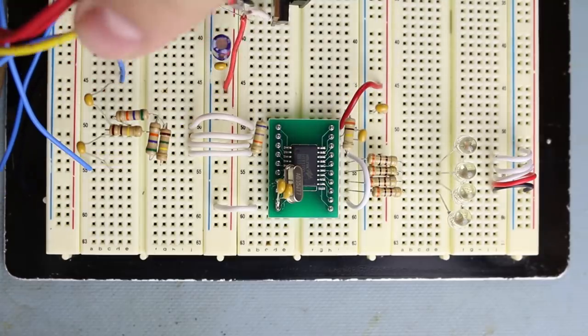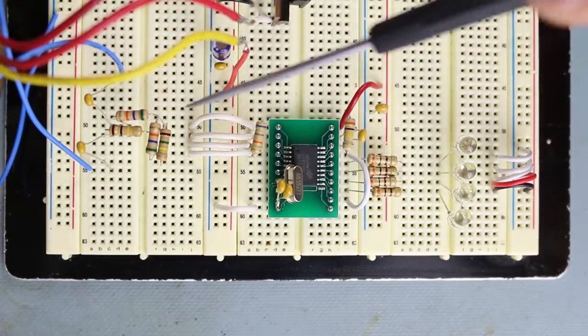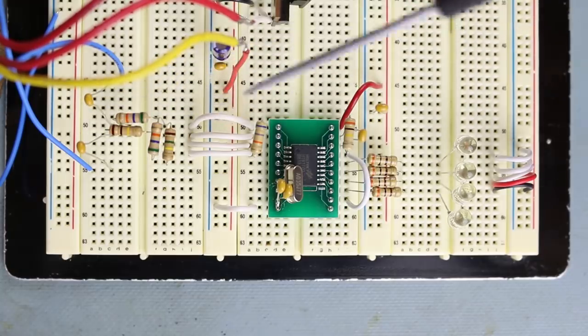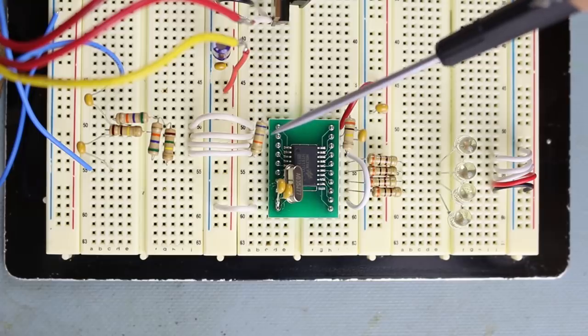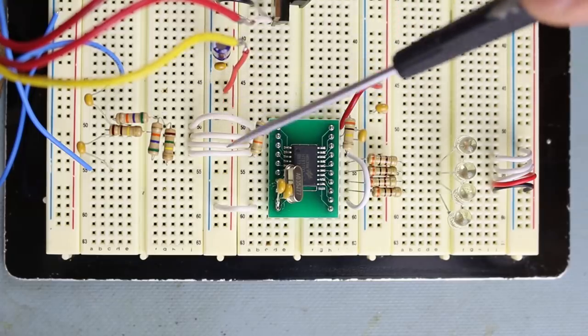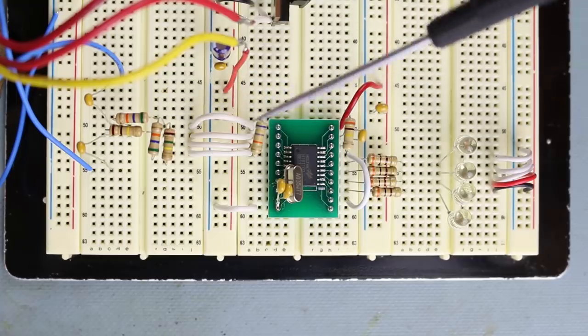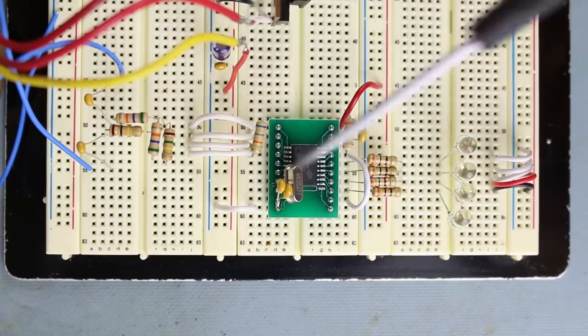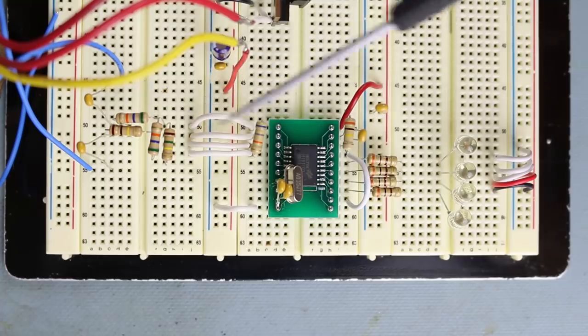So on the analog side of the IC, we have all these resistors and some coupling capacitors that connect to our party line. Now we need to set the gain properly so that the DTMF signal coming in is not clipping or too low. The gain in the data sheet was a little too high at 3, so I reduced it to about 1.5 so it wasn't clipping. It wasn't detecting the DTMF tones until I set the gain properly. I have corrected the values in the schematic.